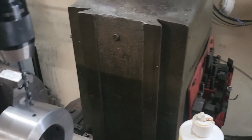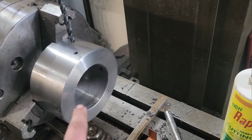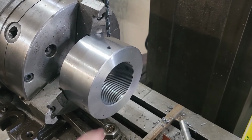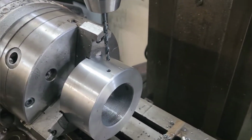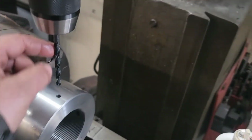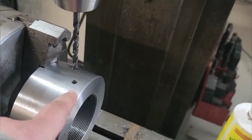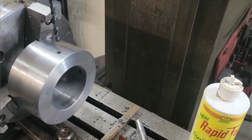And then find the center of this bore, step it out halfway, and I just gotta do four 27/64 holes for a spanner wrench. I'm doing 27/64 so that it can be easily tapped if you'd need to use a puller on it or something. Basically right now I'm running a 1/4-inch pilot down through and then running a 3/8 bit through and then chamfering it. And then I'll probably just tap them on the bench. So I'll do that, I guess, and bring it back.